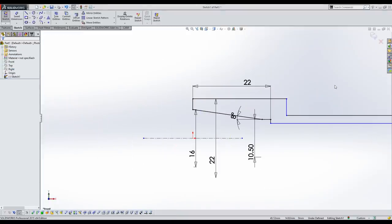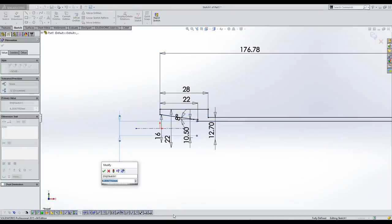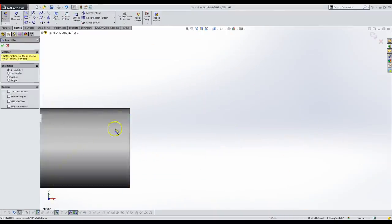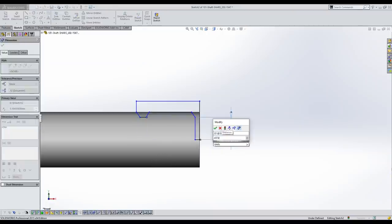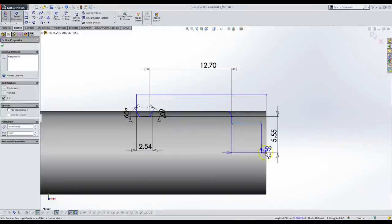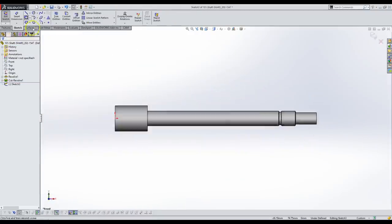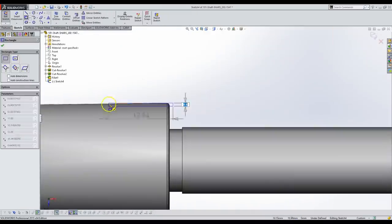Remember when I said there was a fairly prescribed set of steps when designing something? Let's forget about those and skip ahead to CAD — sort of kidding. If this was something important, I would want to know my requirements. I'd vaguely lay out the assembly and then dive into calculations: first I would check power requirements, then the bearings, then the bearing arrangement, then the power transmission itself. I'd check the factors of safety on the shaft, the bearings, the drive components, maybe the motor flange, and I might even do some FEA.